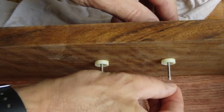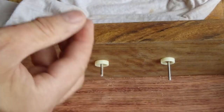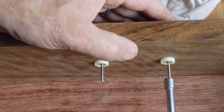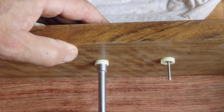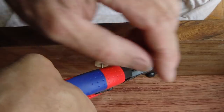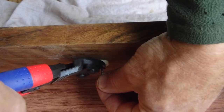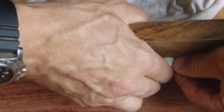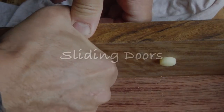These handles come with little plastic caps, which I didn't really love and would have liked to have replaced with maybe an acorn nut or similar. However, the threads themselves are not any known thread size. You would think they'd be 3 millimeter metric, because threads in Japanese equipment are otherwise in metric. But in this case, instead of 3 millimeters, they measured 2.83 millimeters, and I couldn't find anything here that would fit them.